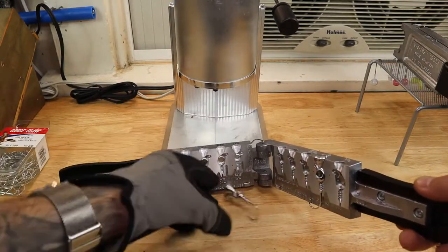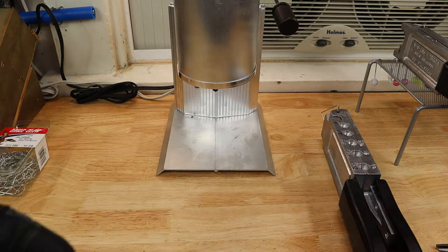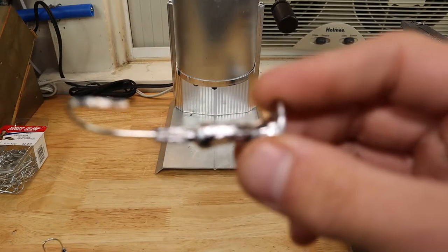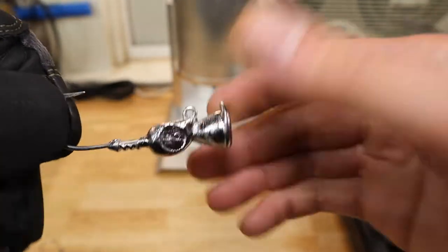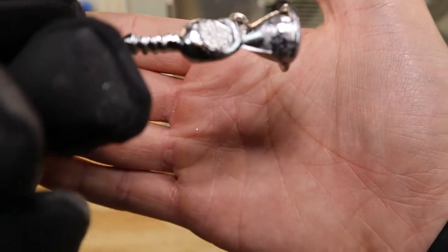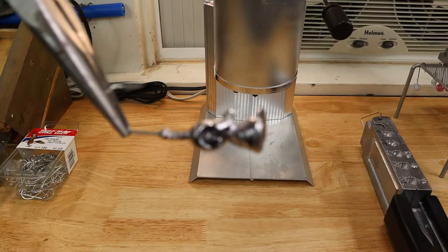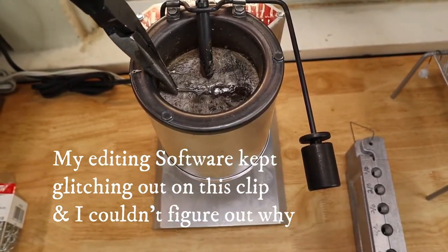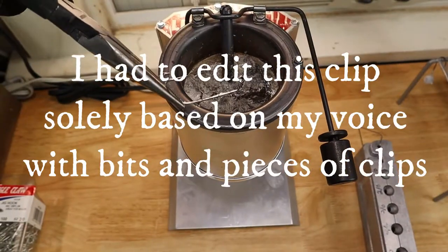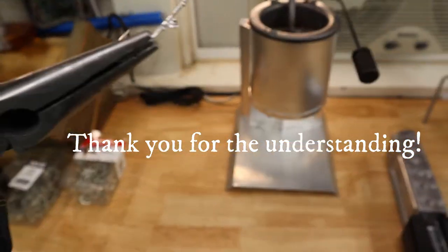Open this up and pull those out. The 4/0 is perfect all the way around, but the 2/0 is missing half of the collar. I'll show you an easy way to save your hook without throwing anything away. Grab your pliers, hold it like this, and just dunk it in to save the jig head - try not to get lead in the eyelet. Sometimes you do but now we can reuse this.